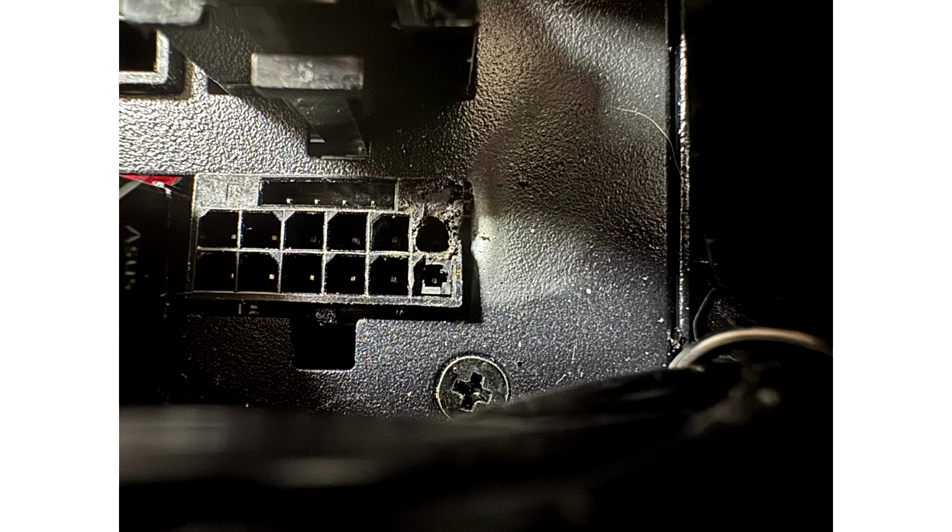As far as this incident goes, it's now looking difficult for the user to claim the warranty due to using a third-party cable. Therefore, it's highly recommended to use the connector supplied by NVIDIA, and seeing what a 12V-HPWR can do to your GPU, using a 12V-2x6 connector is a no-brainer. We hope that the melting problem doesn't carry over to the RTX 50 series as we are witnessing bricked RTX 50 GPU reports, which NVIDIA has started its investigation on.